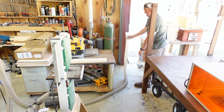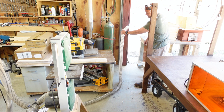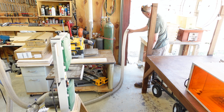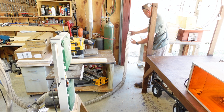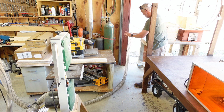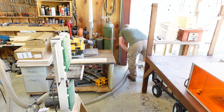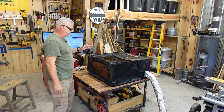All right, this is the other end of the hose — the smoke is coming out this way. This is choking it down a bit because it's more of a two-and-a-quarter-inch pipe, but there is definitely lots of smoke being discharged from here and it's staying clean inside the shop, so it's working. One thing you could do to expedite this is put an inline fan over here to pull from there, which would take some pressure off that little fan. But so far it is venting outside and not coming into the shack.